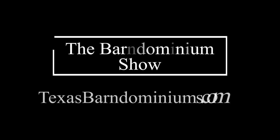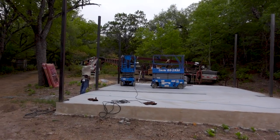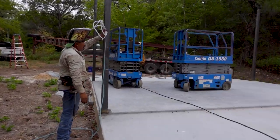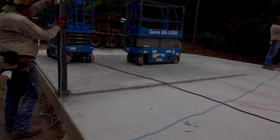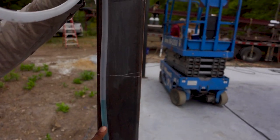We just started the framework at Demolition Ranch. A lot of you guys have been asking about this — we're back. We were just waiting for the slab to cure and finishing up other projects. They have all the columns up using four-by-four square tubing, and right now they are using a water level — just a clear tubing hose. These guys use windshield wiper fluid because they keep it in the trailer and it never freezes.